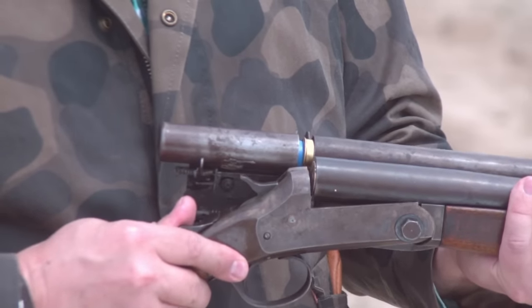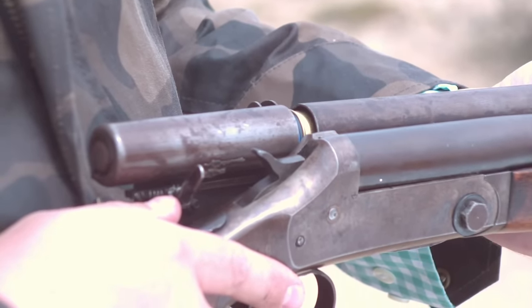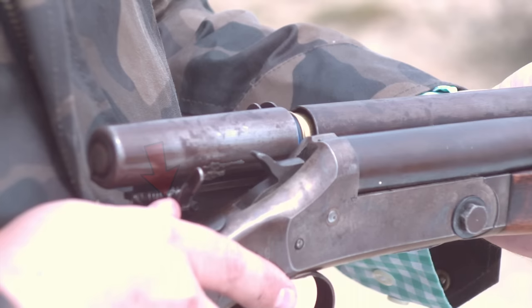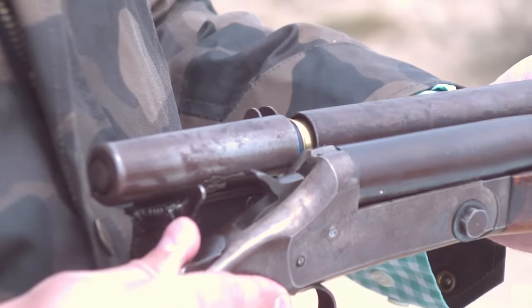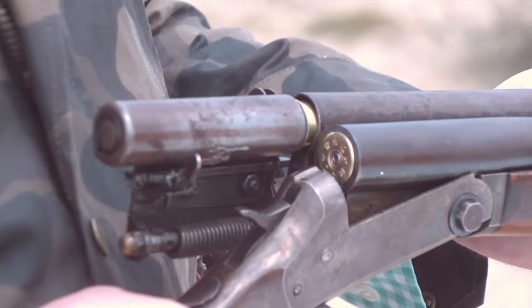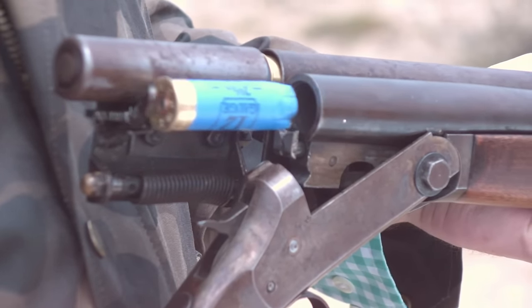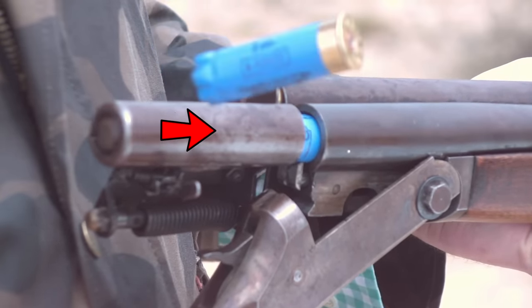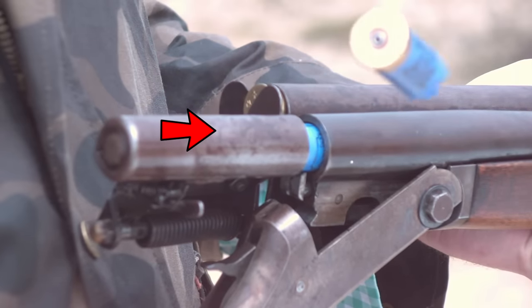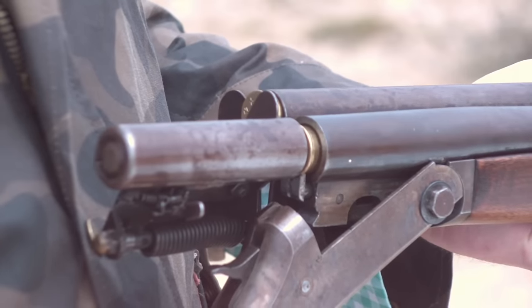Using the Kronos High Speed Camera, we're going to give you a better idea of how this very unusual system works. Othias just took a shot and has a spent shell in the chamber. To begin the process, he presses on this lever to open the action. The system utilizes the energy of the ejecting shell to trigger the mechanism. The shell flies out, hits this tab, and operates a sear, which allows a really heavy spring to swing the transfer tube over. A spring inside the transfer tube shoves the fresh round into the chamber. All he has to do is close the action back up to reset the entire system.